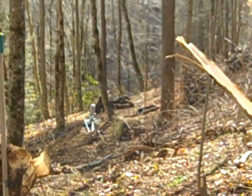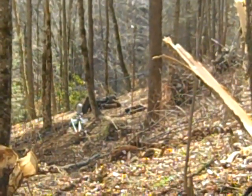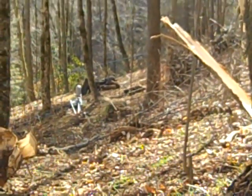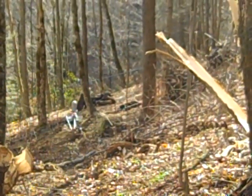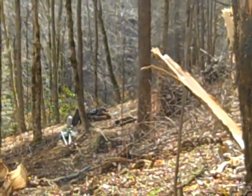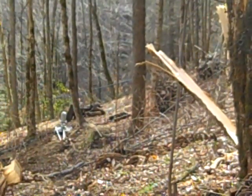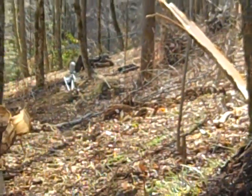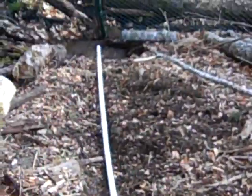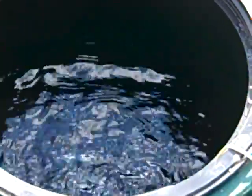The ram is pumping water up 115 feet according to the pressure gauge at the ram. We're dropping the water from this level down to the ram a little over 20 feet, so the ram's not working hard — she's working consistently. We measured almost six-tenths of a gallon, at least half a gallon a minute pumped, which is 720 gallons a day going into the 1,700-gallon storage tank. We've just got some backfilling to do — it's been a lot of crazy digging on the side of this mountain, but I'm very pleased.